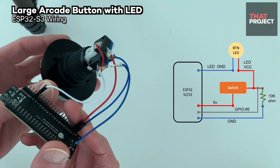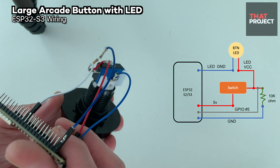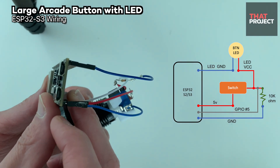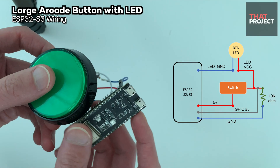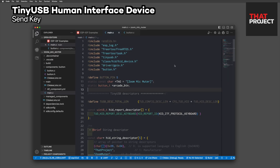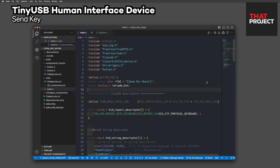The work for the button is the same as the button we normally use. I attached a 10K resistor to the signal pin. When the switch is pressed, current flows from 5V to GPIO5 as a high input. Otherwise, the switch drops and current flows to ground as a low input to GPIO5. You can easily see on the right screen how I wired it up. This program is based on ESP32's TinyUSB example. If you want to review the original example source code, please try the TUSBHID in ESP-IDF example. There is a similar example in the ESP Arduino core, so you can try both of them.